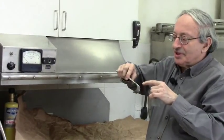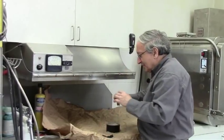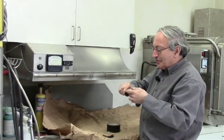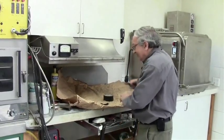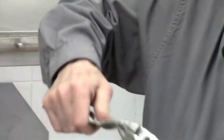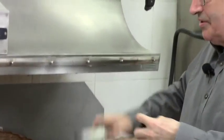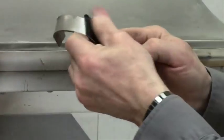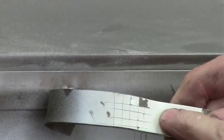Okay? Now this tape isn't that strong, and this paint is not bad. So this surface was not prepared, but it's still borderline, because for example, if you bend it a bit and then you repeat the test, see, it looked okay, but it's actually not a very good paint job, because if I bend it a bit and I repeat the peel-off test, now it looks bad. Okay, so what it means, it's not a real bond.